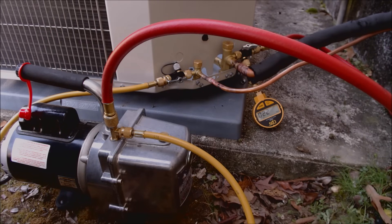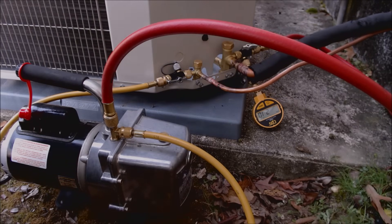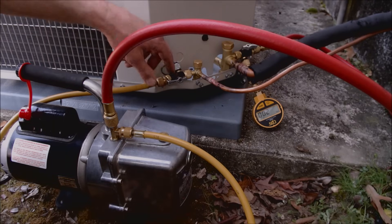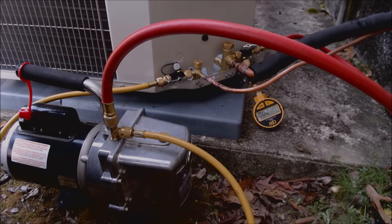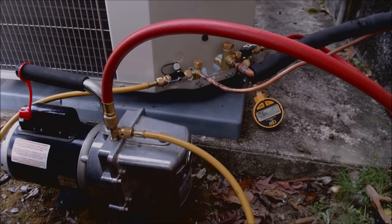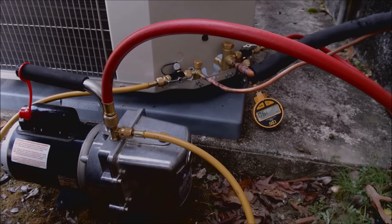We're just about down to 200 microns, which is my target. When I get down there, I'm going to shut these two valves off, turn the vacuum pump off, leave the micron gauge valve in the on position, and just read the micron level to make sure it doesn't rise. The less hoses you have, the less restrictions and the faster the vacuum will go. When I valve these off, that'll be a test to see if there's a leak in the system, or if there's any water that got frozen and is thawing and expanding. That typically will only occur if you're using a 6 CFM or 3 CFM pump on something very small like a refrigerator with a lot of moisture in the lines. If you're ever concerned about water freezing, just leave the evaporator fan running — that'll put a heat load on the evaporator coil to help with evacuation.